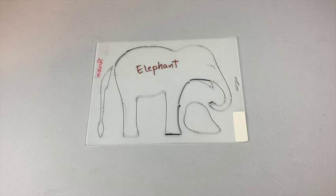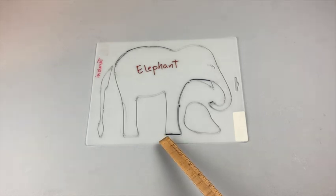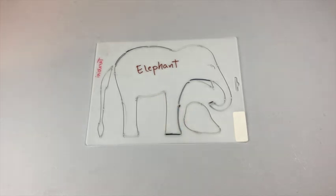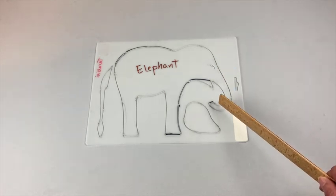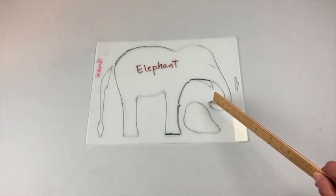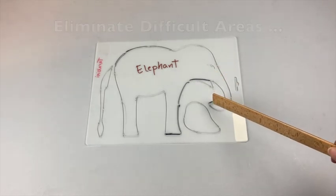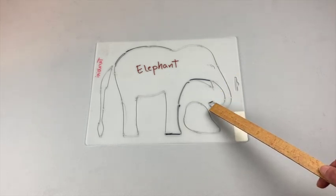No matter which method you use, as a beginner you'll want to make some adjustments to the pattern. These little areas where there's a corner on the outside or a crevice on the inside are a little more challenging. Just about any shape except an oval or a circle you're going to encounter those, so it's good to learn how to deal with them. This area in the mouth where there's a point and a crevice, and the area on the trunk where there are two points and a crevice, are much more difficult. So what I like to do is just cut those out — do away with those on the pattern. You'll still have some corners that are challenging but not as bad as before.